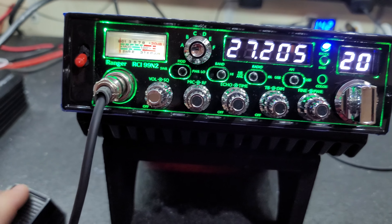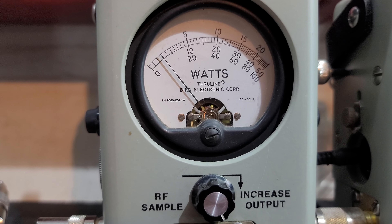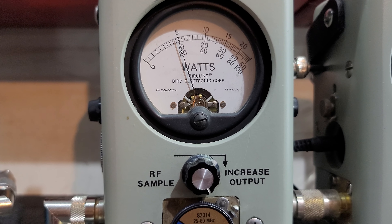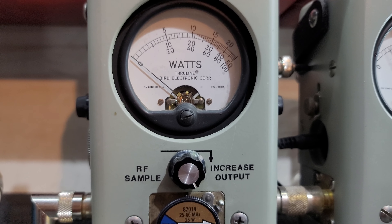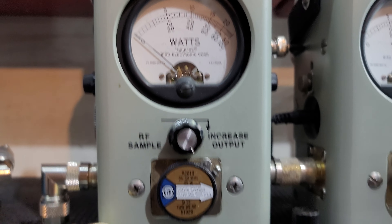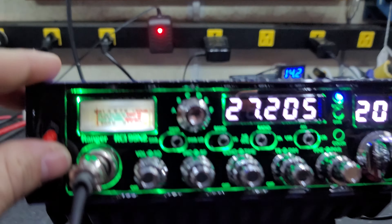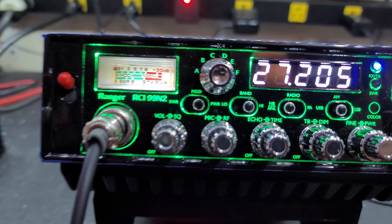There's your amp on-off switch. I'll show you with it off. 25 watt slug — about a watt and a half, maybe two watts all the way down. Five and a half all the way up. I'll show you average power swing. About 20 bird peak power. 45 peak. So you can run a lower drive amplifier with this if you want.